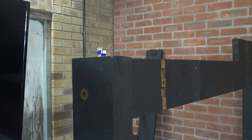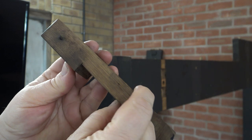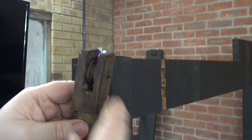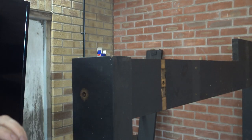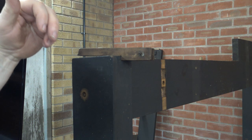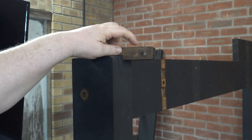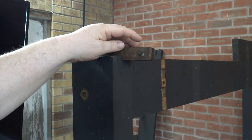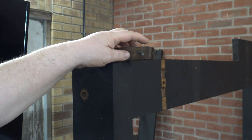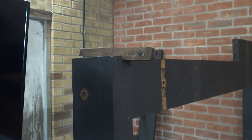What we've got here is a piece of wood with a pulley in it — a wooden pulley on a pin. Normally we take that out, grease the pin, put it all back together, and that's it. Yesterday on the first take, this was painted black — they slap-dash painted this black as well, and you don't do that. This doesn't do anything anymore, but when this organ was hand-pumped there would be a cord going to the bellows top. As the bellows top rose with the wind in the organ, a lead weight on the end of the cord would go up and down — a telltale for the person pumping by hand to know when the bellows was full and when it needed more air. It's had a blower on it since 1950.